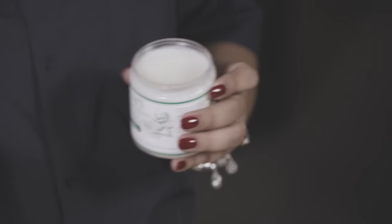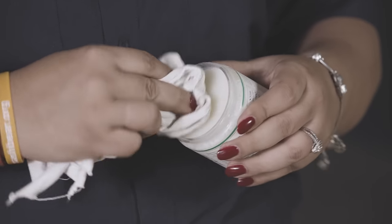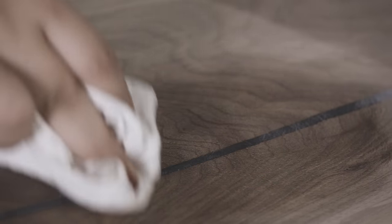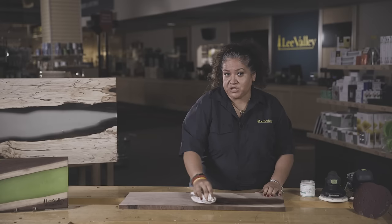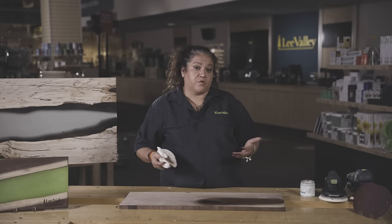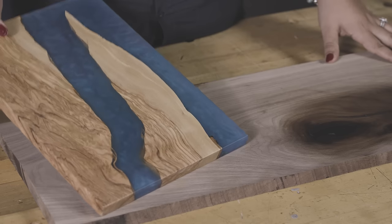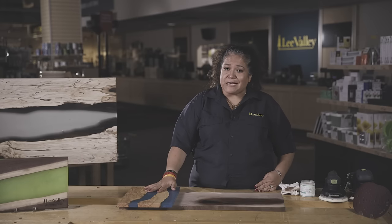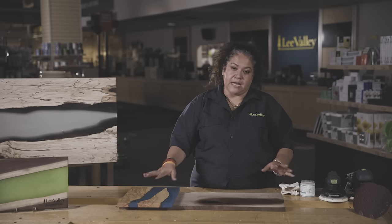I'm going to show you how to apply a little of this onto your board so you can see the difference. Use a cotton rag, pull some wax onto it, make sure it's thoroughly covered, and start working it in. As you can see, the epoxy starts to darken and you can see the difference between the wood and the epoxy. Cover your entire board and you're ready to go. You can use a variety of different finishes — this board used an oil finish and has a totally different look. It's pretty easy to make a really great gift with a few simple steps and just a little creativity. I hope this video has shown you how fun and easy it is to work with epoxies and inspired you to do your own projects. Have fun with it!